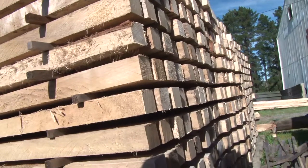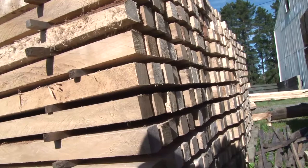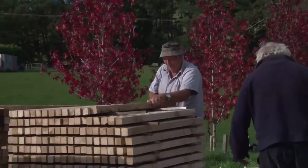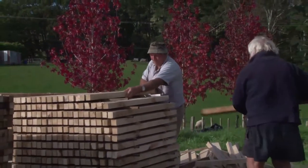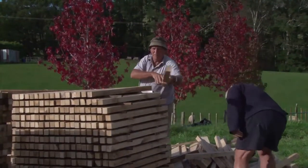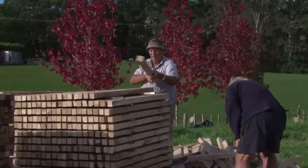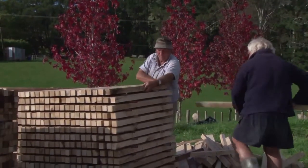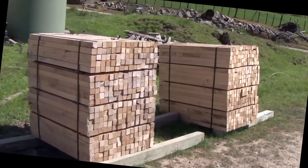To be properly prepared for the treatment, one needs to have the bundle of a size to suit what the treatment station can accommodate. So find out what size your bundle needs to be. In this case, a bundle of 300 battens, made up of 4 by 75 battens, all spaced with fillets, and all the fillets in a straight line, was required. Then it's just a matter of strapping the battens or posts ready to be taken to the treatment works.